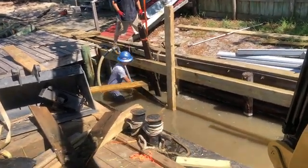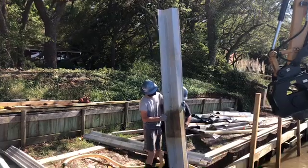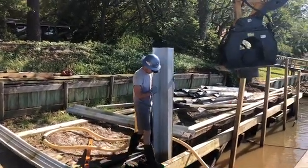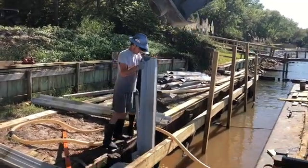That's a whaler. Huge 10-foot sheets — trying to get them back in line. It's kind of hard to do because the wall already had a nice little bow in it. We're going to go ahead and hit it with the vibratory hammer and drive them on down.